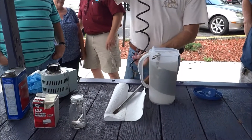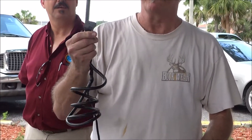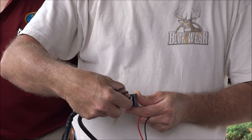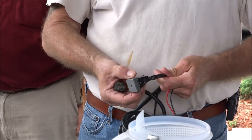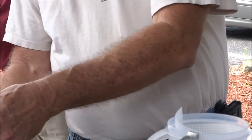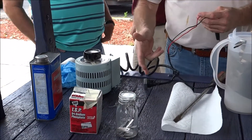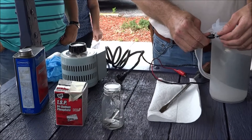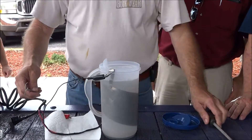This here is a DC rectifier — you can get it at Radio Shack, like under five dollars, or buy them on eBay. There's a slew of them on eBay. The part number right on here is 5322 DC rectifier — $4.99, ships to your door free. It's got four terminals: 110 in, 12-volt DC out. Just plug this in there, put the variac on zero. Now you've got 110 volts going to this rectifier. Hook the negative to this.